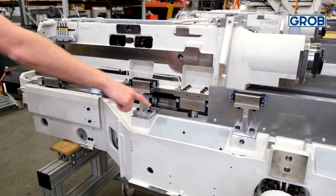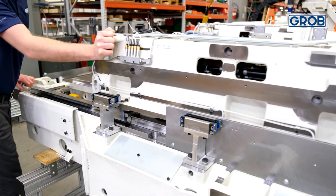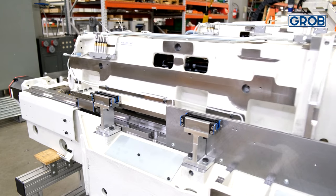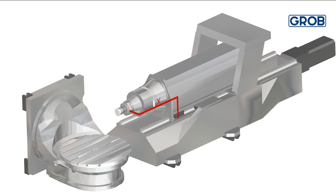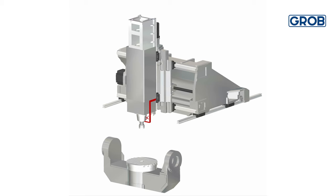On our 5-axis universal machining centers, the z-axis rides on three sets of bearings that travel with it, keeping the distance between the spindle face and the bearings the same throughout the entire z-axis stroke. When the spindle is extended to the part, the z-axis bearings are centered over top of the x-axis rails. This makes the machine most rigid when extended to the workpiece. Many other builders have machines with stationary bearings and the rails travel with the z-axis, which results in a poor lever when extended to the part.